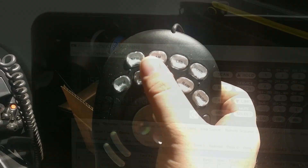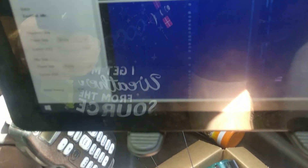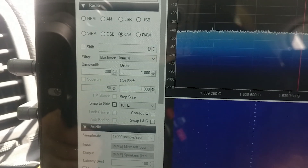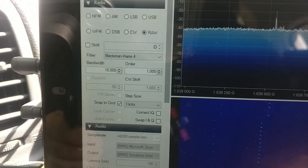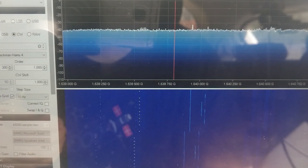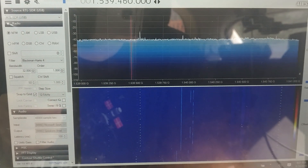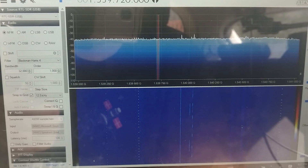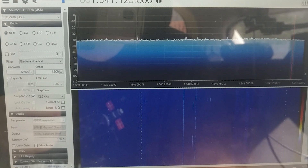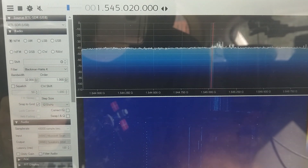Another reason I use a Windows tablet in the car is for something like this Contour Shuttle controller. I can pair this with a plug-in and SDR Sharp, which most of you are familiar with. This allows me to easily, with just one hand, switch between all of the available demodulators, the available bandwidth, move up and down the frequency bands, and even control the zooming aspects of SDR Sharp — essentially giving me full control using nothing more than the Contour controller, which typically is used for video editing software.